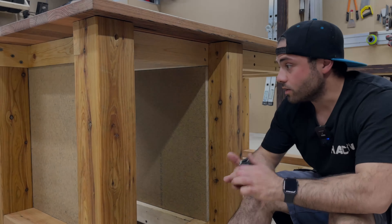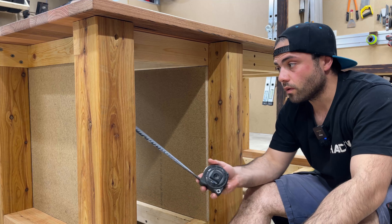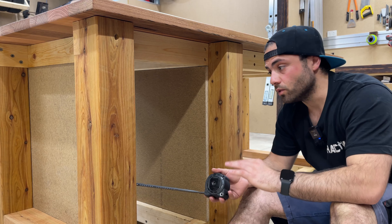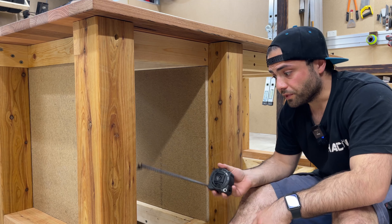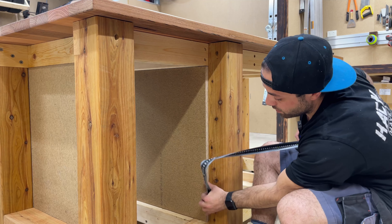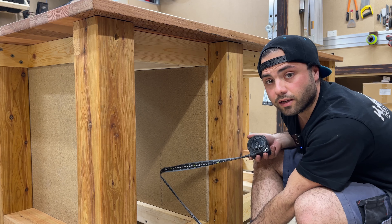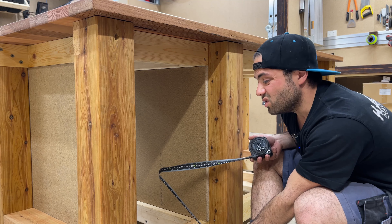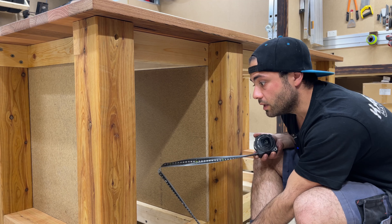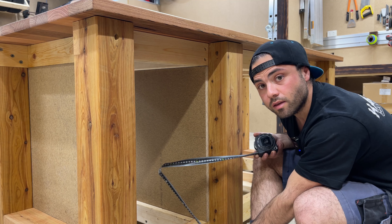I've marked out the heights I want for all the drawer spaces. I've got three smaller drawers and a super skinny drawer at the top, and on the other side I've divided it in two for two deep drawers. I need to work out the actual drawer heights — they need to be a bit less than the opening to account for any sag in the runners and material. I usually leave about 10 to 20mm between each drawer unit. Then I'll knock up some drawer boxes and get the runners screwed on.